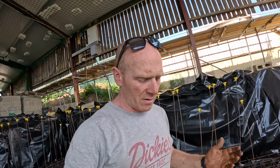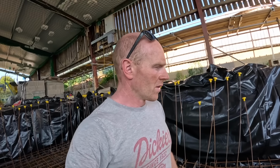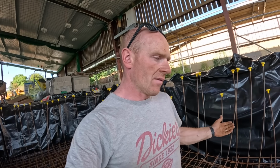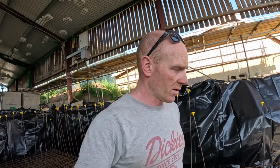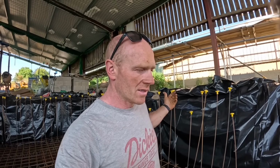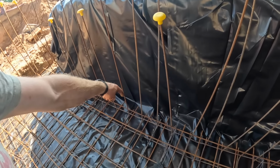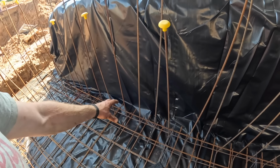It's not the most expensive thing, this rebar, but it's fussy and it takes time. You can get all these L's made up. I think it was a 10 working day or a week or so to get done, but we didn't have that, so we thought, keep going, and we just bought the steel, and as you saw, it was pretty quick to bend. This is only 10 mil steel, so it's quite easy to bend by hand. We got a more accurate bend in the workshop with the big metal vise, but the radius we're getting on these is absolutely fine.